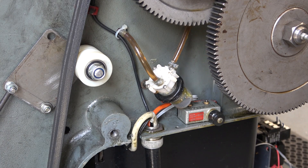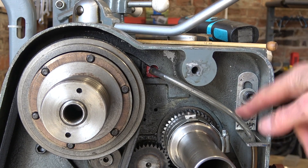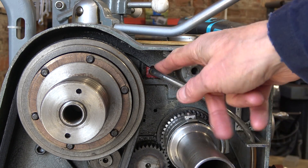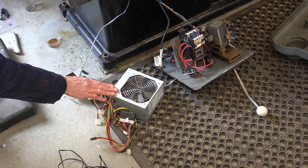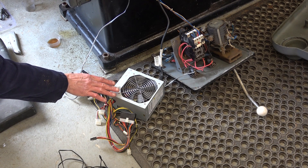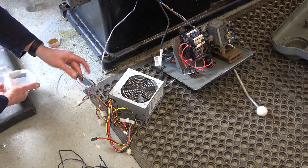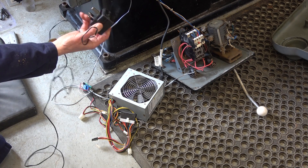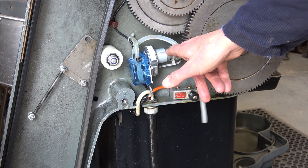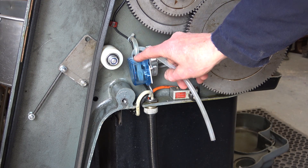There's a better shot of the pump — I'm just draining off the oil from the pipes here; it's just dropped down from the gearbox. This is where the oil feed goes into the lid — there's a brass fitting there and the pipe sneaks in under that corner. I had a PC power supply, which are really useful — they supply a whole range of different voltages at very high power — and I had a timer in a box. All that can be replaced now by this one little plug-in power supply. It's now screwed into position and wired up. This will be the feed going to the spindle bearings, and this is the supply coming from the gearbox oil reservoir.